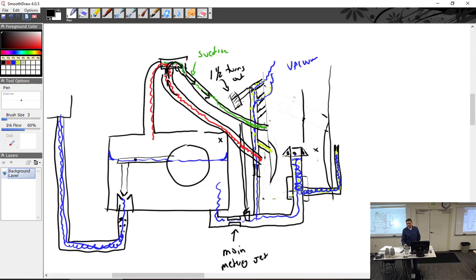So then the question becomes, we circle back around. We have idle mixture. And what is idle mixture? A properly set carburetor idle mixture, when we pull the idle cutoff, should rise and then down. So this carburetor, now the Stromberg, I pull it back and it does nothing. All day it does nothing. Because it doesn't work at idle, because there's no suction.